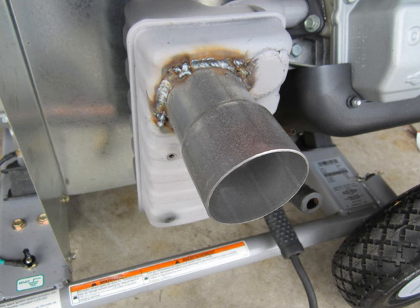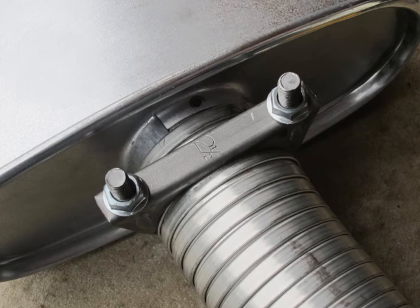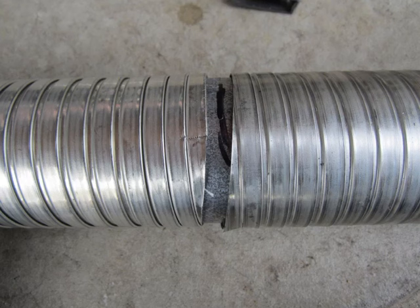I am not a skilled welder, but I managed to get a reasonably uniform bead, which I then spoiled cosmetically when I tried to place spots of weld to close the holes where the spark arrester screws had been. The next step was to attach one of the two flex pipes to the car muffler. I found that even though the muffler inlet fitting was marked on the box as being 2.5 inches, it was actually a bit smaller, and the flex tube's 2.5 inch inner diameter was too large to fit well. I fixed this by using tin snips to cut a strip of scrap tin, which I then wrapped twice around the car muffler inlet fixture to increase its diameter slightly. Then I used one of the U-bracket clamps to firmly attach the end of a flex pipe to the car muffler inlet fitting. Next, I joined the two flex pipes with the exhaust connector and two U-bracket clamps.